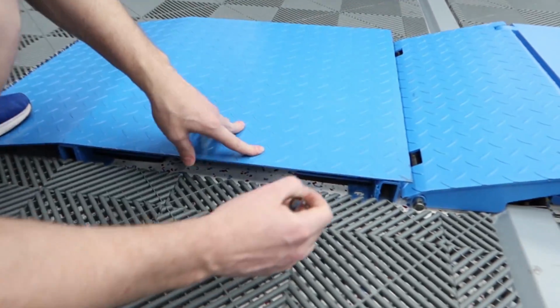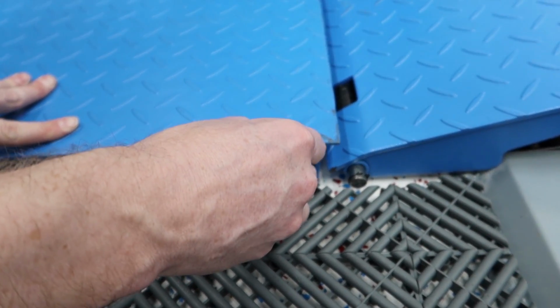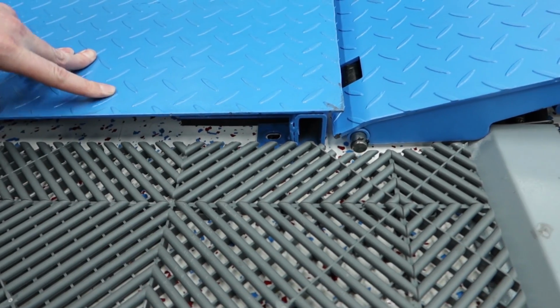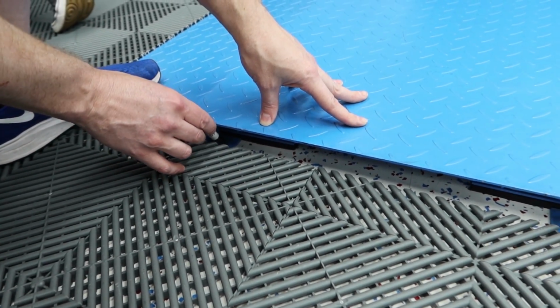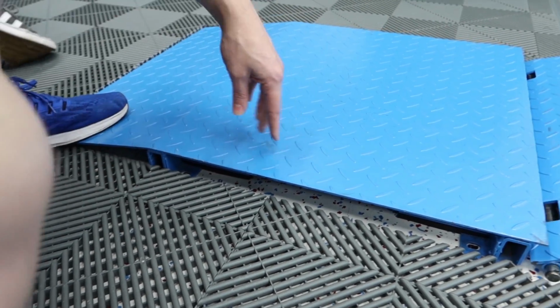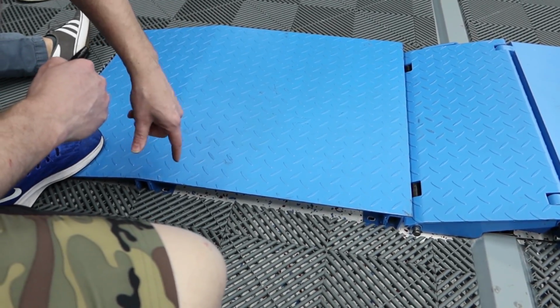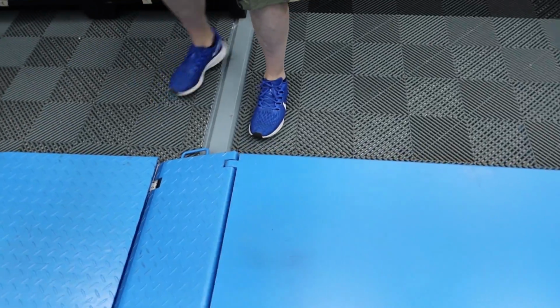So these are a little tricky because you can't get a pen in there straight. So I'm coloring this in. And I'm going to drill on the outside of this. Because my marker's at a pretty steep angle here. So we're going to put some, whatever you call the sleeved anchors, so you can set it on top of them and bolt it on.